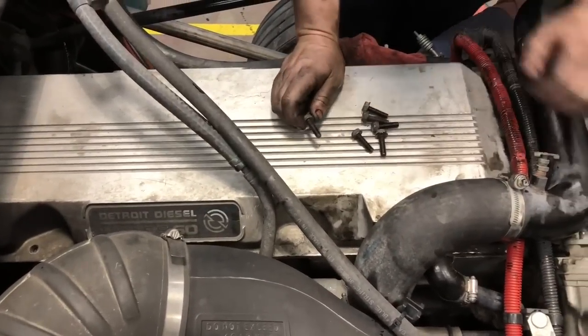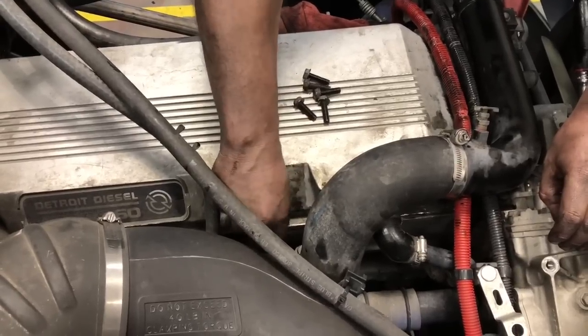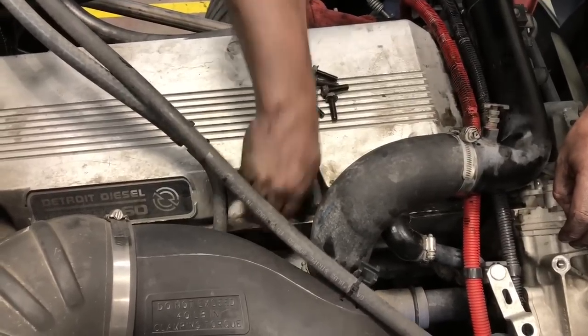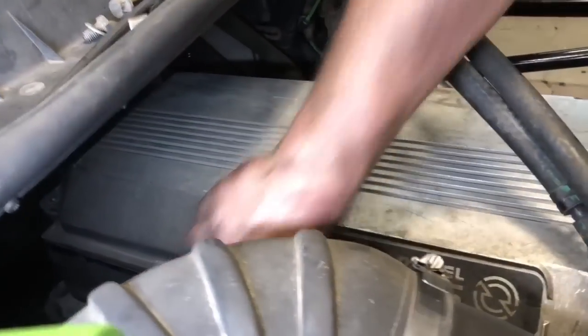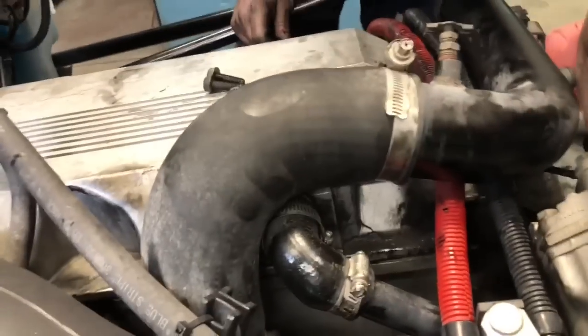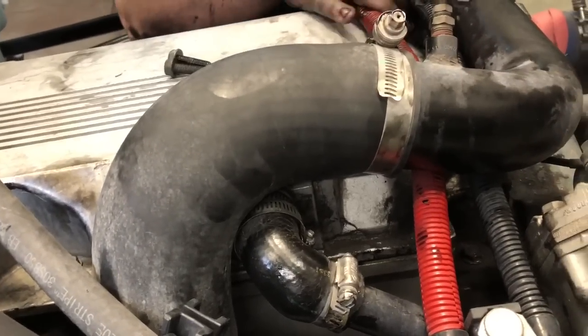Start all my bolts by hand. Just trust me, it's not any fun trying to helicoil one of these valve covers on top of the engine. An impact doesn't know if it's cross-threaded or not. It ain't got no feel. It just knows two directions.